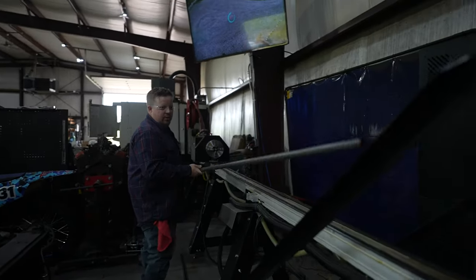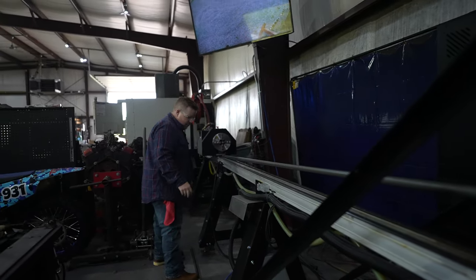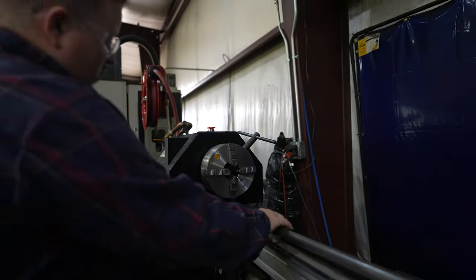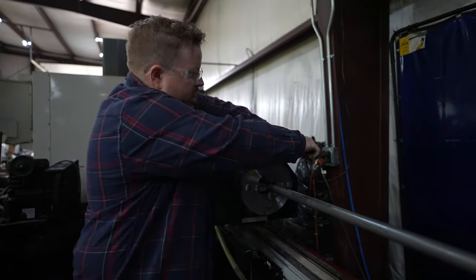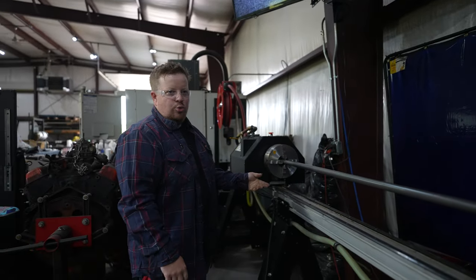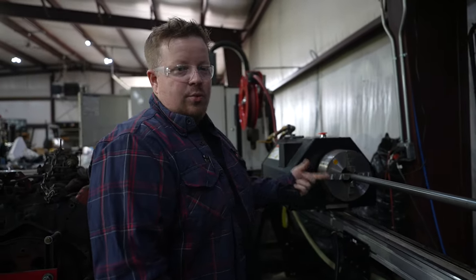Whenever you change material sizes, you have to change what's called the gate up front, right where I'm putting the material in. It's already been adjusted for one-inch tube. Put this little plug in here to stop all the coolant from leaking out everywhere. This machine does have through-spindle coolant. The Dragon here is a CNC tube plasma, 12-foot version, so we can fit 12-foot tubes in. It cuts notches and marks all our tubes for fabrication if we're going to bend them — it automates the process of notching layout for our bend lines.